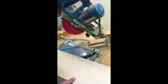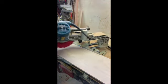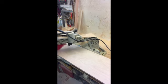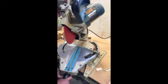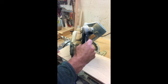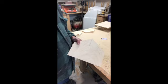Then on your chop saw, you set your blade to 35 degrees. Set your stock against the backstop. Bring it right up to that single point you have marked, and make your cut. Adjust your chop saw the opposite direction, go right out to 35 degrees. Set your stock right back up where it was, and make a cut the opposite direction. And there's your gable end.